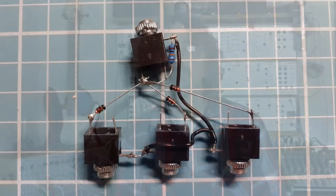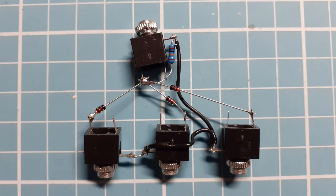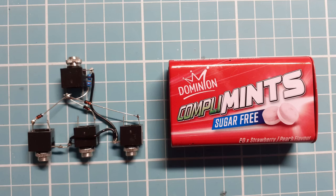There's no circuit board involved. As with the low-pass gate, I've simply wired everything directly — dead bug soldering — and the finished result looks like this. Then it's just a case of mounting it in the box, and when it's mounted it looks like this.